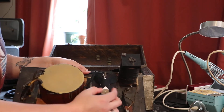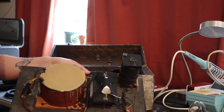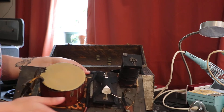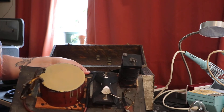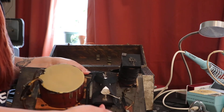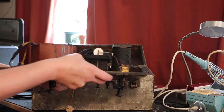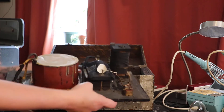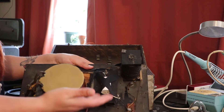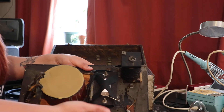This is actually a Cornell capacitor. These are really popular with Tesla coil builders — modern Tesla coil builders — and they are great for restoring these old things. The old capacitor underneath here is actually lead foil and mica. What happens a lot of times is ozone buildup causes the lead foil to just fall apart, so these capacitors are often no good.